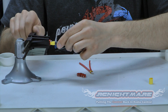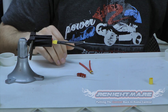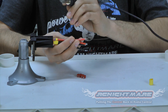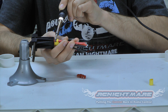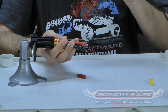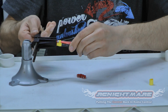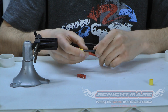Now I'll do the positive. The trick with this parallel soldering is that because we have so much wire and solder, try to do it as quick as possible — we don't want to melt the Deans and we don't want to melt the wire either. Take your positive and same trick here. You can see how that little bit of heat shrink tubing is helping me right now — those two wires tend to want to fall apart and it's helping to hold them together. As I wait for the solder to flow all the way through, you've got to make sure you watch as the solder melts all the way to the bottom so you know you've got a good strong connection. I've got my red wires on — solder flowed all the way around.